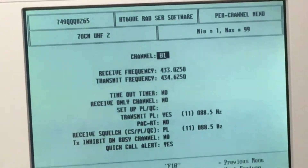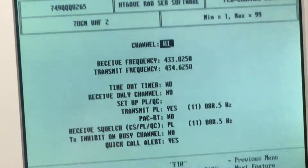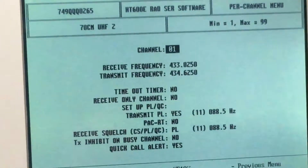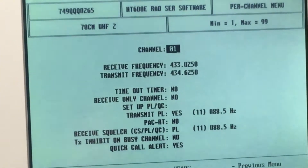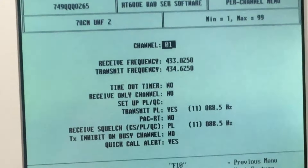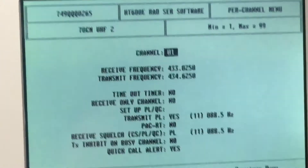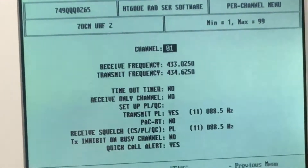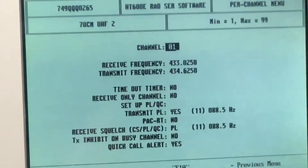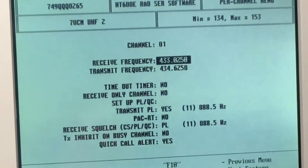This radio is on amateur radio frequencies — we've taken it out of band. I'll explain in the next video how you take these radios out of band in the programming software. It's done in the config file using a text editor like Notepad that can edit the physical hexadecimal code in the config file — that's how you change the band split info. You don't have to modify anything in the radio physically. There are things on the internet about cutting tracks on boards, but you don't have to do any of that — it's all done from the software.